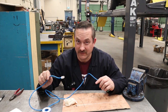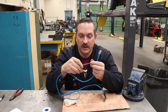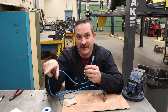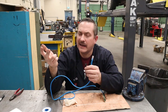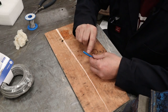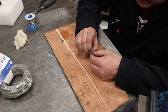Since I don't know the final resting place for this board or how long it needs to reach, I'm just going to trim the end. Then I'm going to pull out a couple of wires and solder on one of these — a 3-pin JST male connector — so I can plug it into the female connectors on any of our LED strips or matrixes. When peeling back the outer sheath, be careful not to cut into the wires underneath. Make a slit at the end and then peel or tear it back.